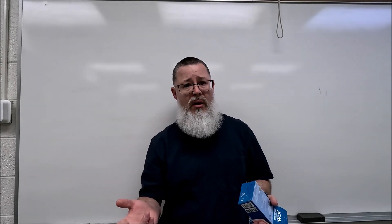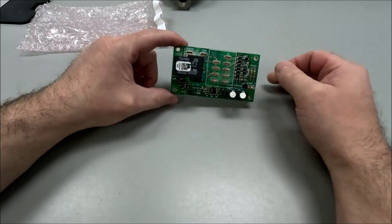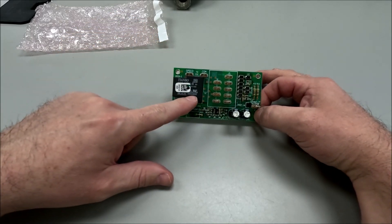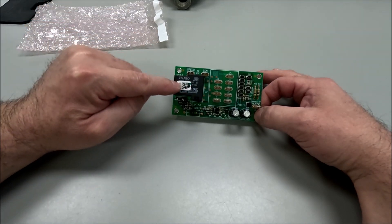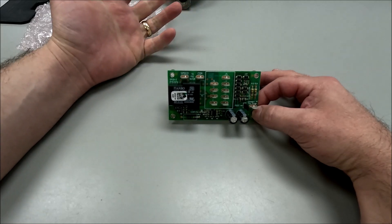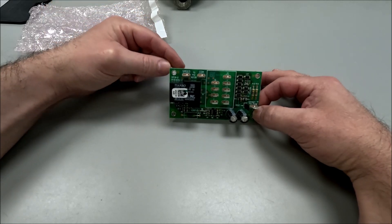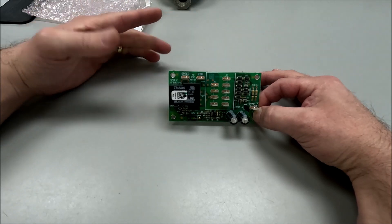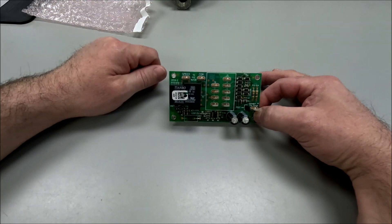I've got two air handlers in the back — one with the board already installed to show how it looks, and another to demonstrate on. Out of the box it's saran-wrapped with a single-page set of instructions. You'll see the little black pieces which are probably the relay, and it gives you some voltage and amp readings — pretty standard stuff for something that looks like an air handler board. Right on top it says 'to PSC motor,' with your speed which is basically your L1 side, and your common which is your neutral or L2. Per the instructions, it can handle a 120-volt or 240-volt motor.